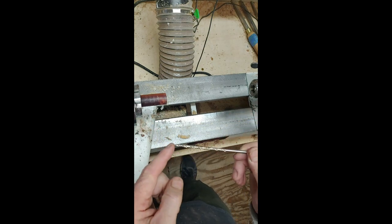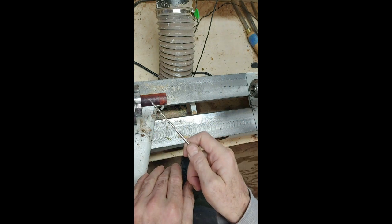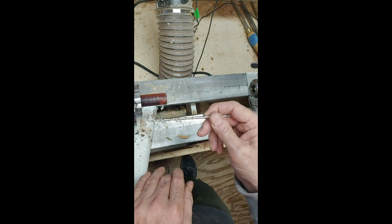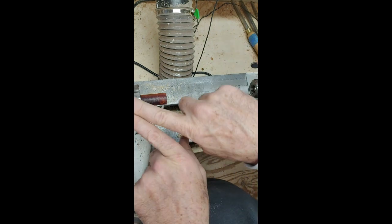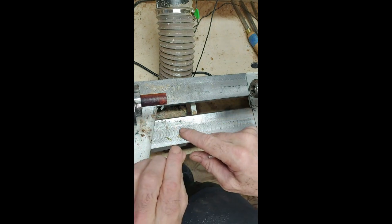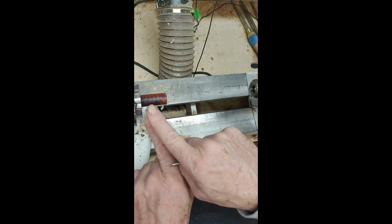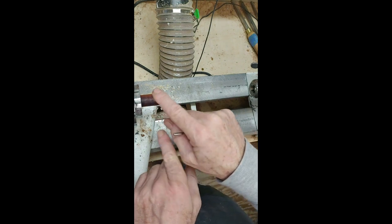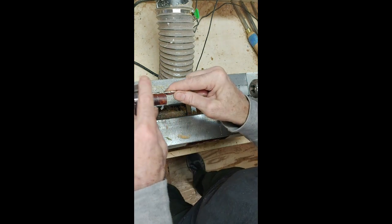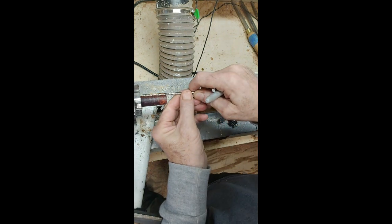Millimeter tapered bit. You see this comes to a fine point there, and what this does is this gives a sort of a gradual closing down of the opening inside this piece of acrylic. So as we get to the end, I've got enough room to get my funneling tool in there, and then what I do is I expand the opening this way as opposed to this way, and then by expanding it this way, I'm able to keep the height of the opening as small as possible, so that I can reduce the outside thickness of the bit without cutting into the draft, because I've done that before, and that's just not a happy experience, because generally that's a thing that will happen at the very end of the process, and I don't like that.